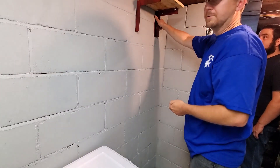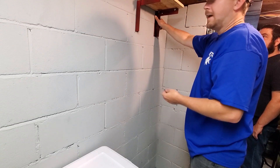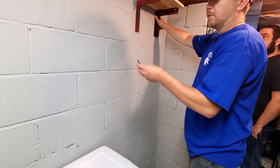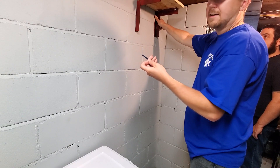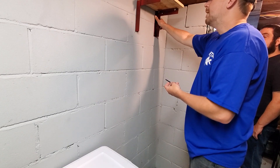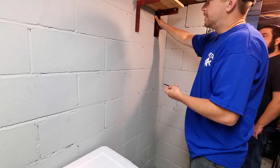They don't last the longest from what I heard, but mine has put at least 50 of these TapCon screws into these concrete cinder block walls and they hold extremely well. I don't like to use a drill to fully put these into the concrete — I like to hand-tighten them, because you can easily strip out the concrete on these. Just a little word of advice there.